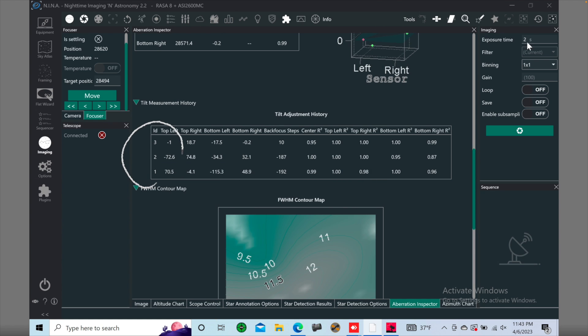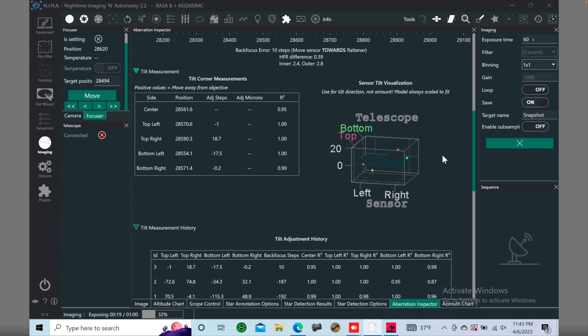I've made three attempts so far. By looking at the table, it gives you values for each corner — those are the error numbers. Don't care too much about the actual numbers; what you want to look at is which one is the largest. If it's a positive value, you have to move away from the objective. I looked for the largest positive number each time and would go to that corner and push the TILT adjustment screw. I would always change two adjacent screws — if I pushed one screw in to go away from center, I would also loosen the adjacent screw. And make sure your four locking screws are unlocked when you do this, then lock them again, because if you don't, you might force one side in too much.